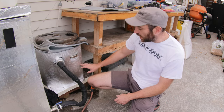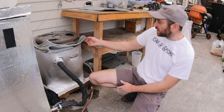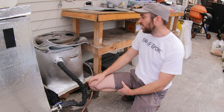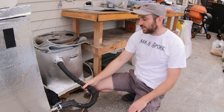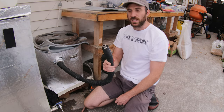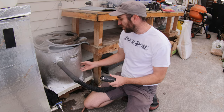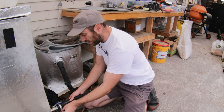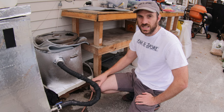For this test, I've added a fresh insulation wrap to my boiler and sat some new PIR board on top. You can actually see it's leaking — you can see the steam coming out. These are inefficiencies; you can feel the energy coming off that. That's releasing kilojoules out into the atmosphere instead of going through the pipe into my tank. This boiler is just a bit too old now, and that is one of the reasons I'm replacing it. We want to make this as efficient as possible to chase that target number.